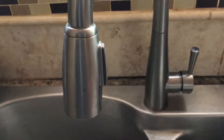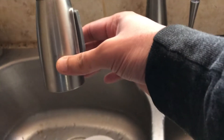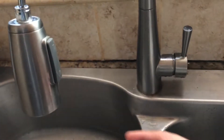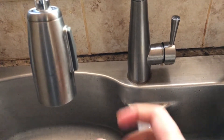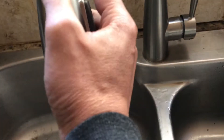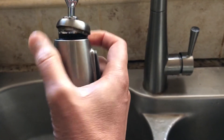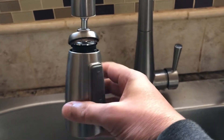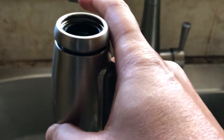So how do you repair this? If you have a faucet like this, you just pull this part and you need to remove it to see if any dirt or dust particles are stuck inside. So if you have this model, it probably looks similar to Delta. You need to remove the top part — all you need to do is rotate the top, then remove the bottom. Just rotate a little bit twice and this will come up. As you see, the top part has come out.